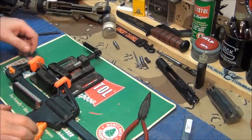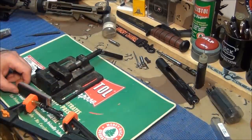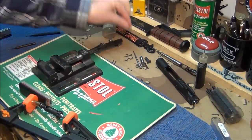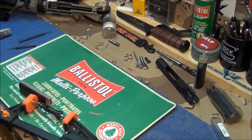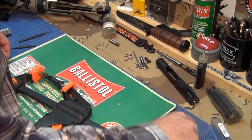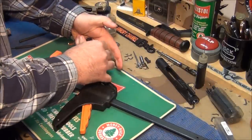It popped right out. Now - if you're working on guns, you've got to get a drill press vise. You need c-clamps, you need all this stuff, because if you have to struggle, that's when you screw up your guns. You start getting pissed off - I preach that in my videos all the time. Now I'm going to slowly release the clamp and the spring and ejector pin will come out. These are really tiny parts - you've got to pretend you're working on a watch. You lose one thing, you're going to be really pissed off and ordering parts from Brownells again.